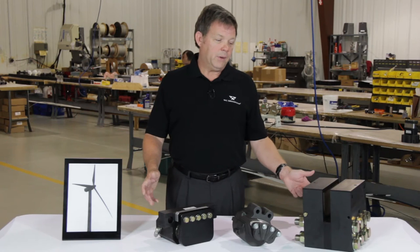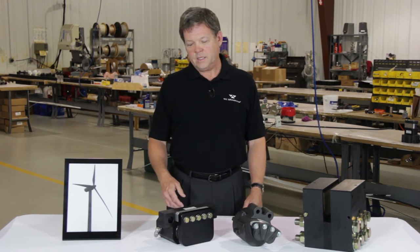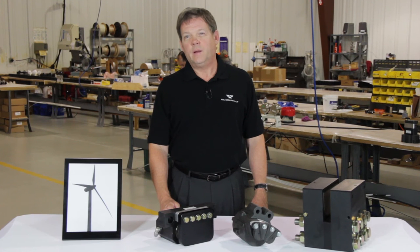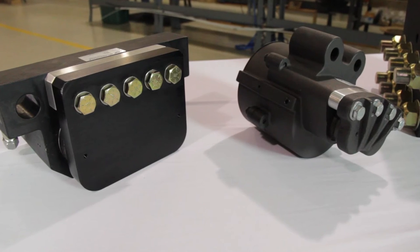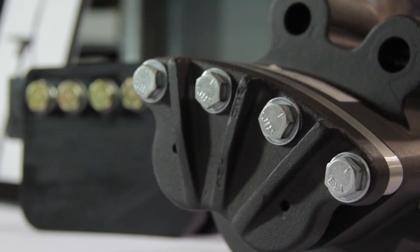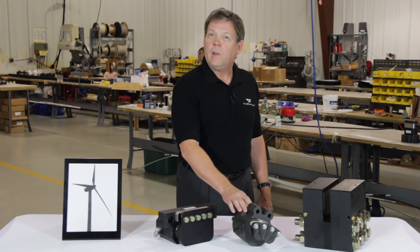Here are a few basic types of wind turbine brakes. The first two that you see are spring-applied brakes. It's critical that a brake apply in a fail-safe situation — if there's no power, the brake applies. This is important at high wind speed: if something's damaged, these brakes apply.